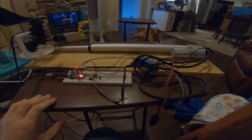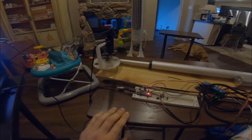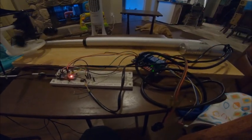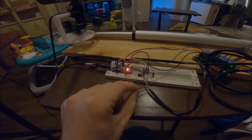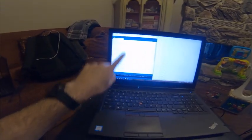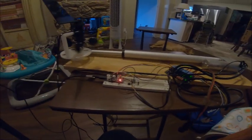I have everything set up and working on a proportional controller only, so it's not a PID controller currently — just proportional. I'm still working on the PID portion, but I wanted to get something working and start tinkering with it. What I have here is an Arduino Nano and a little YW Robot relay pack — honestly this could be anything, any sort of relay assembly. I have my anemometer coming in here. This is the wind sensor, the wind speed — I'm not using it, although it is spinning for this sketch, it's not being used. A sketch is the program that you write for the Arduino. I'll put a screenshot of this up so you can kind of see what's going on. I have the linear actuator, the base that we 3D printed, and the anemometer is now mounted to it. We'll go ahead and plug this in and I'll walk you through how it works.